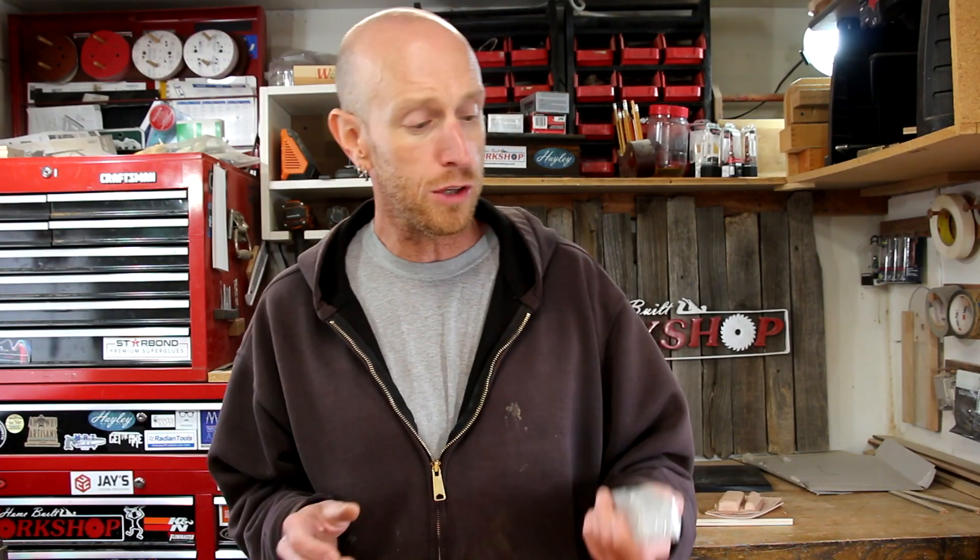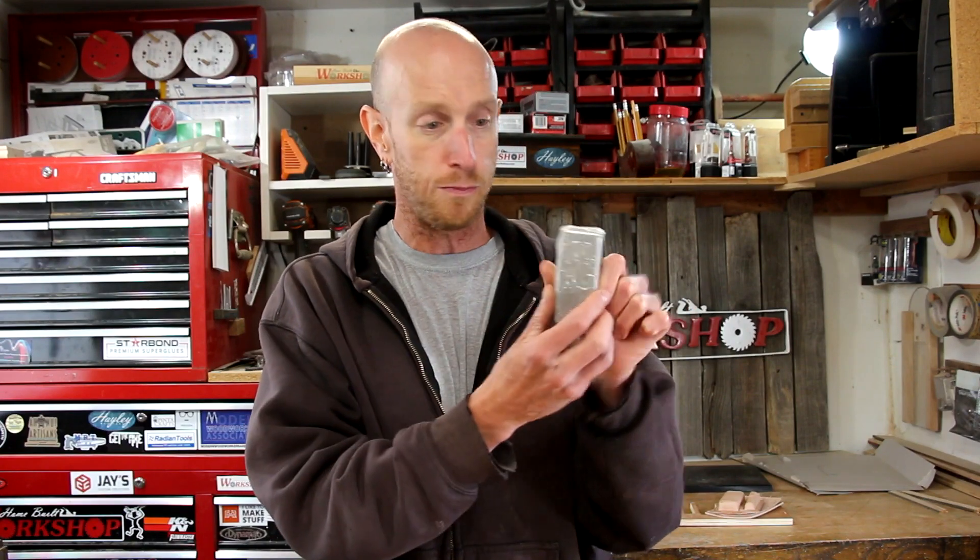Well, you're in luck because there is. You guys probably already are aware that there are companies out there making these looper pedals where you can plug in all of your different effects. What it actually does is creates another effects loop, much like you'll find on your amp, but these are selectable by a foot switch. Today we're going to build just a small one using a small project enclosure — just a single loop, going in and going out, selectable. You can duplicate this design again and again to get whatever size you want, but for what I need, the single looper is going to be just fine.